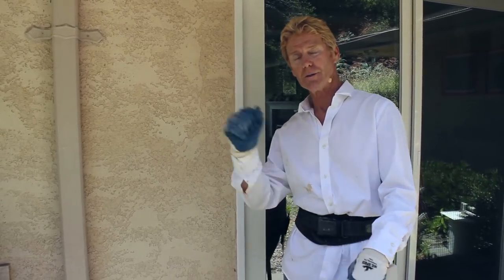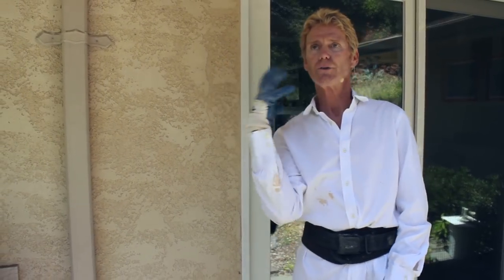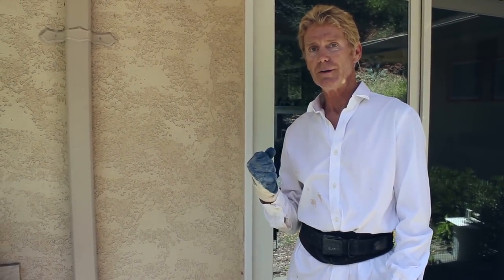A couple questions I've been getting a lot of response from. People say, Kirk, we're doing a color coat, and as fast as we put the trowel full on, it dries and absorbs. They ask, should we use a Weld-Crete or a bonding agent? And I said, no, just hydrate the walls. I'm going to explain what that is.